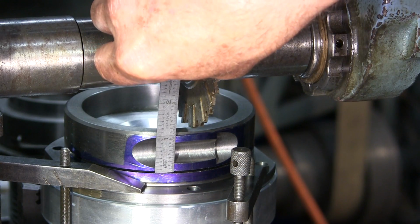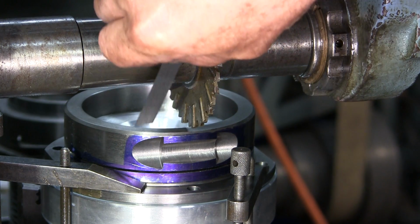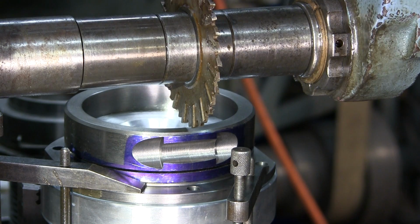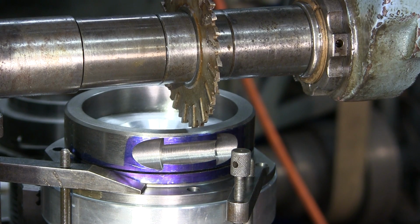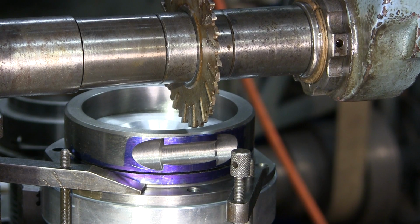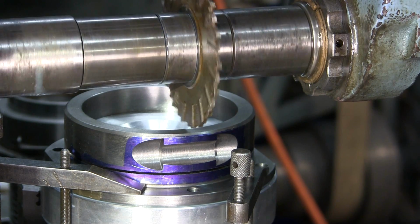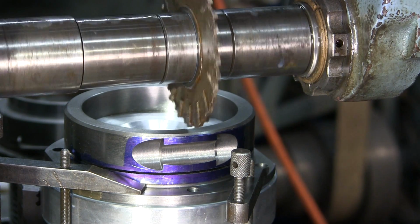We're just doing a last measurement right here, and we're just under 1 inch as far as the height, maybe 975 from there to there. When we start touching there, I'm going to set my 0 on my dial here. I just want to make sure I get the screw here. Okay, it's loose. For RPMs, we're going to be at the lowest, which is 35. And we're not going to run any coolant. I just moved the coolant line.